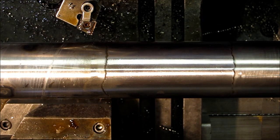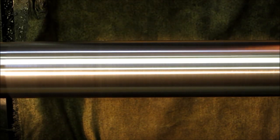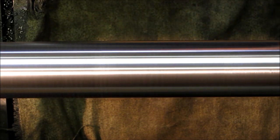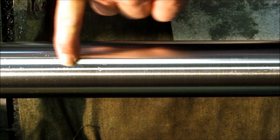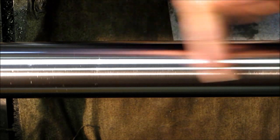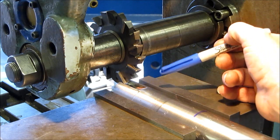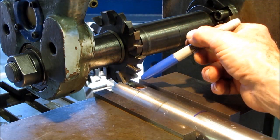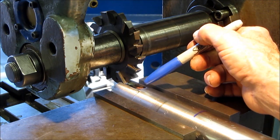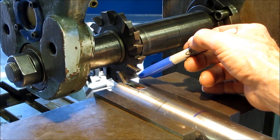We're right down to size. Just going to polish and blend these in a little bit. We got one little spot there — probably no bigger than the rest of the little hammer dings around here. We got a good seal diameter right there. Now we're looking at extending the keyway down to where we want to have full contact in the coupling. This is where they cut off the shaft and lost their keyway, and that's not enough to run the coupling properly. So we're going to put that in there. We've already faced off the saw marks, chamfered it, and put the center drill in so we can run it in the lathe after.